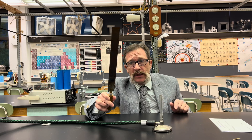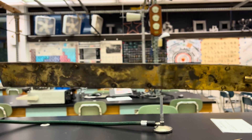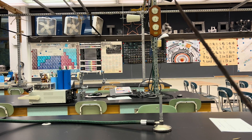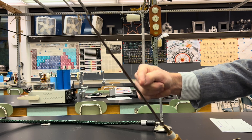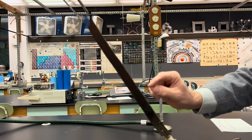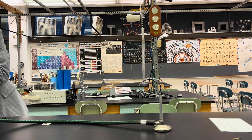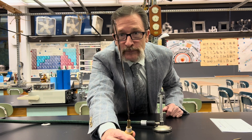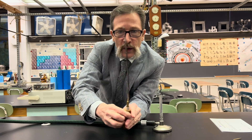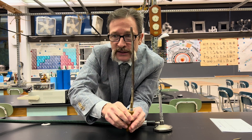Let's go ahead and analyze this. This is very hot so I don't want to touch it, but each one of these pieces of metal in between the rivets are bulging out — popping out, popping out, popping out, instead of curving the metal one way versus the other. Now that it's cooled, it does tend to bend a little bit. But what's happened is there's a deformation on each one of these panels — it's popping out instead of having the rigidity to cause the entire strip to bend.